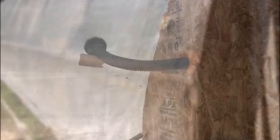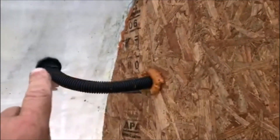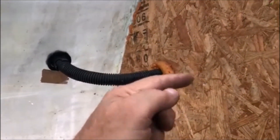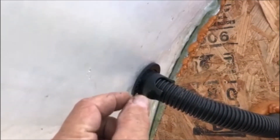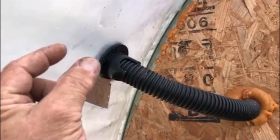If you do, you have to put a jumper — and they look like this. This is a jumper in the lettuce house. I've got it going between the end wall and this panel because the end wall is separate. I'm using the air provided by that blower to come down and fill this whole bubble up on this whole side, and when it fills up it'll press air into the other side between these two panels. There are two layers of plastic underneath, so it'll inflate that. The jumper is connected to the inside piece of plastic — it doesn't have to push away because that's already inflated anyway.